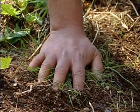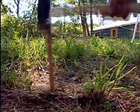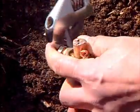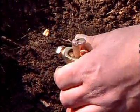If you still feel no tingling, your grounding is okay. If you do get that electrical tingling feeling, add more ground rods. Or contact an ElectroBraid customer service technician for advice on grounding your fence.